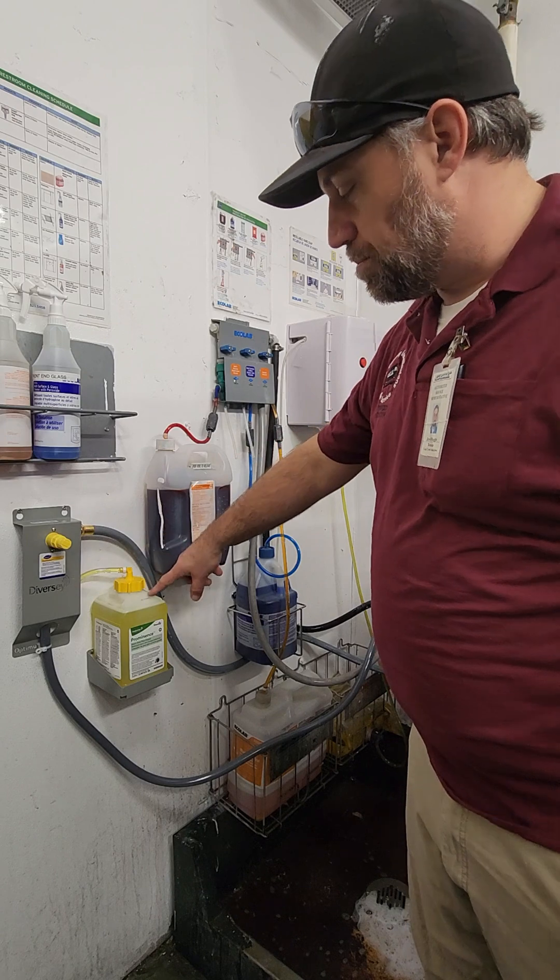Hang your hose up. In order to make this stop, all you have to do is turn your water off. Once the pressure's off, that water will stop. The reason that is there is to tell you the water's on and the system's pressurized. None of these devices are supposed to always have pressure going to them — it will cause them to break. You want to turn it off at the faucet.